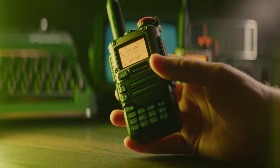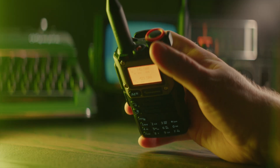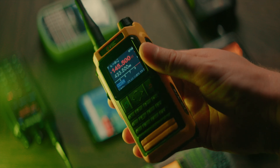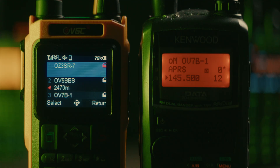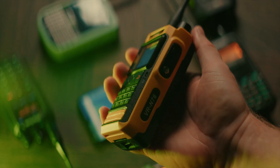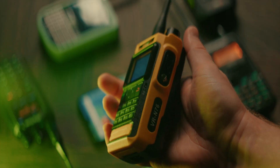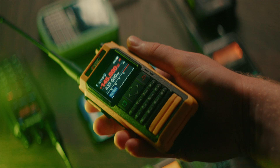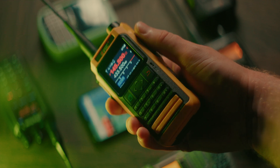The really cheap radios can sometimes have problems with poor filtering and easily overloaded receivers. This radio, however, has no issues with spurious emissions. It's not as sensitive as my old, much more expensive Kenwood D72 when decoding APRS packets, but it does a very decent job — and it's way better than using an APRS-K cable with a cheap radio and a smartphone. The battery life is also very good; I've had it run for more than a day at constant full-screen brightness, GPS on, lots of APRS beaconing and listening to radio channels, with plenty of battery left in the end.